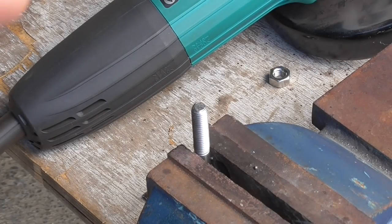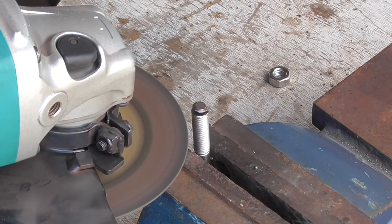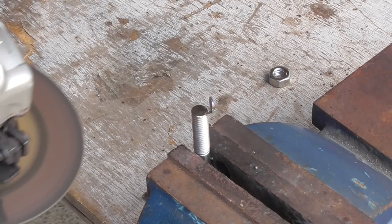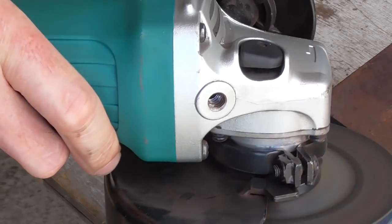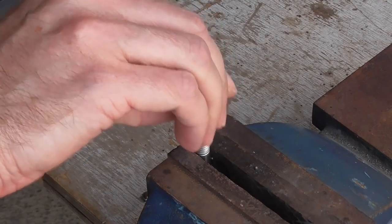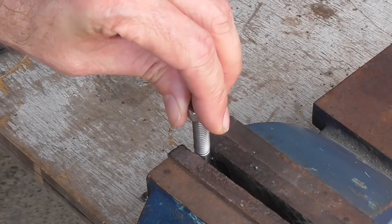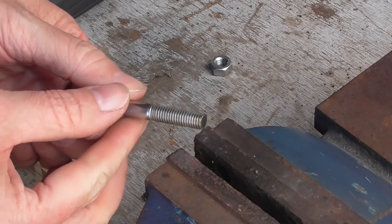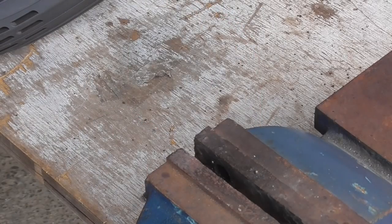I found you can do a very good job with almost no cleanup needed if you just wait a little bit at the end. Right before you cut that last little bit, stop and give it five seconds or so to cool down, then just tickle that last little bit off. That particular one didn't quite work out perfectly - it'll need a little bit of belt sanding. The nice thing about these larger bolts is it's easy to see the problem, and it'll take about two seconds on the belt sander.